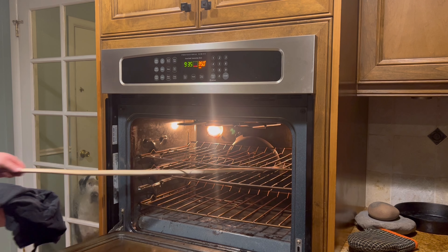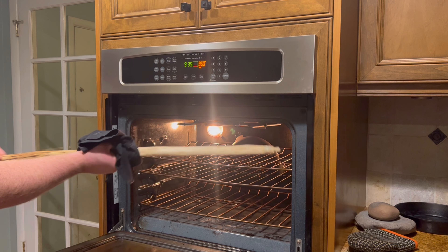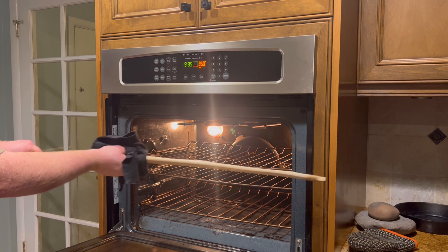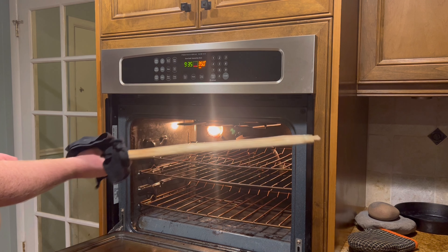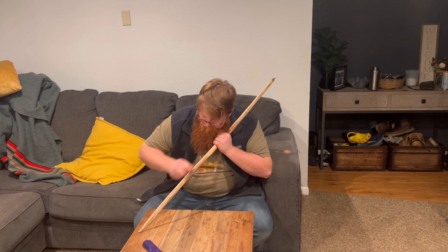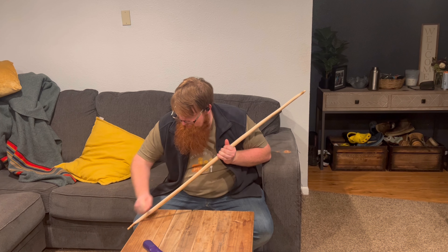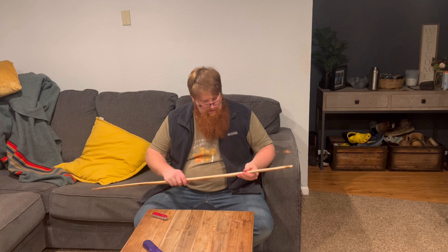Living in town in my backyard I don't have a campfire, so I just stuck it in the oven to heat it up. The book says it needs to be rubbed with all the animal fat it can absorb — I'm just using olive oil. What you're doing is waterproofing and sealing the wood, giving it some protection from the elements. To paraphrase the book: rub it until your arm gets sore. I'm using the smooth side of the handle of my Swiss Army knife to burnish the wood — really compress all those fibers and help seal everything in and strengthen the wood. Just settle in and watch a movie, because you're going to be doing this for a while.